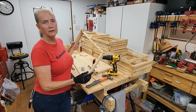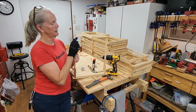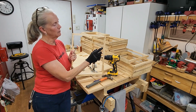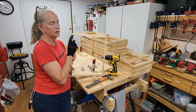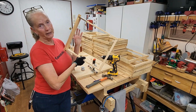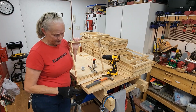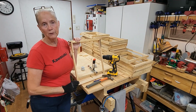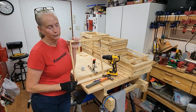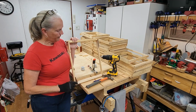The wire is attached to the frame by these two little nails that are hammered into the frame, and Roy helped me out by pre-drilling these holes and starting the nails in. We're using Southern Yellow Pine for our frame parts, and it's very easy to split even using these really small nails, so it works a lot better to have them pre-drilled. Roy's done that for me, and these are all ready to go.